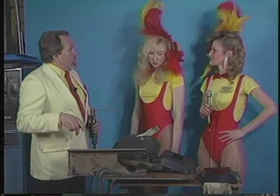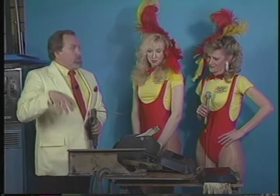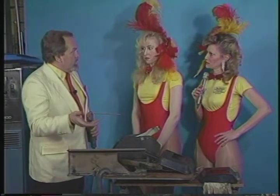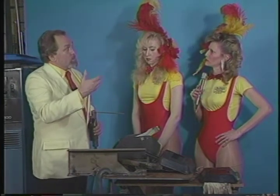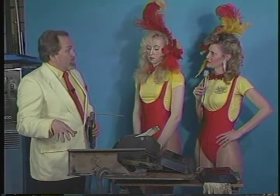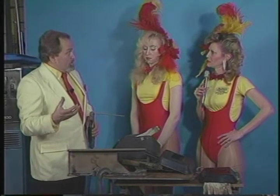Another thing I can mention, safety-wise: when you weld on a piece and it gets good and hot, don't put that piece on a garage floor. We tend to think of things like concrete or bricks as able to take heat, right? It can't. There is a term for fire brick and for stone materials that can take heat: refractory materials. Unless it's made of a specific refractory material, there is always moisture in it. You put the hot part down and the moisture wants to expand because it's taking the heat of the part, and boy, will you get a little hard explosion. It'll toss the piece in the air.